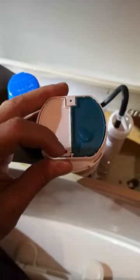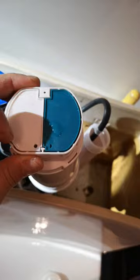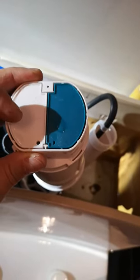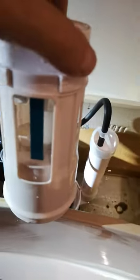There are two little circles on top of the mechanism: a big circle and a half circle. The big circle is for max flush, the half is for half flush. Your tab here should be at the bottom for max pressure, for your water output. The same thing with that little floater — it should be completely at the bottom to give you max pressure.